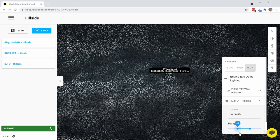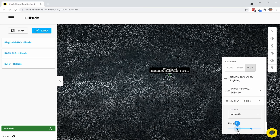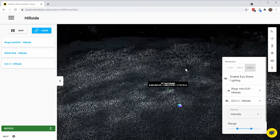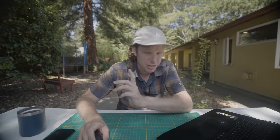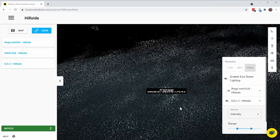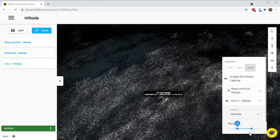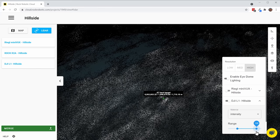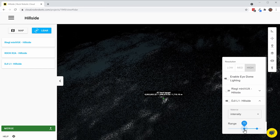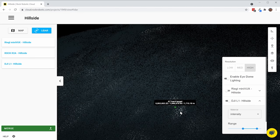Now, this is because the RGB camera and the laser scanner aren't perfectly aligned, so there's a mismatch there, and that's pretty normal. So just a rule of thumb, you should always be looking at an intensity view when you're aligning your LiDAR data to ground control points. Just always do it. So this right here is the control point. You can see it if I zoom out a little bit. I'll adjust the intensity, try making it pop a little bit better. You can clearly see that's it right there, two white sides and two black sides.